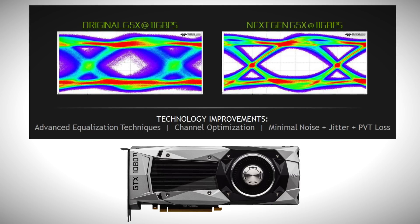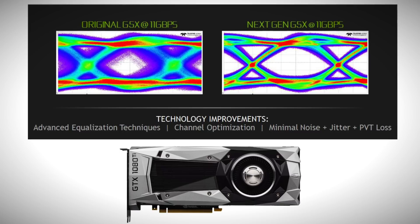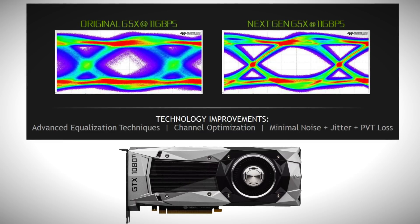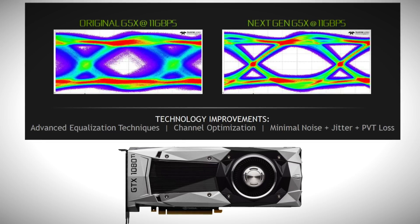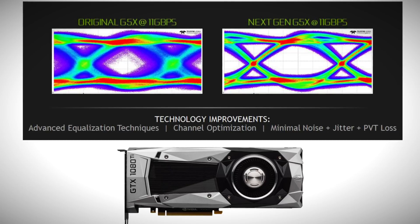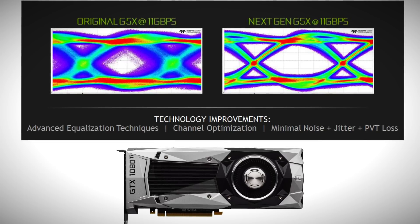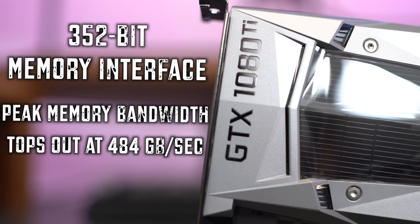The big thing they've done with GDDR5X is make it work absolutely better. Instead of having any clutter, the new generation tech means the memory just works much better all around, making the card run faster. The image on the left shows the original GDDR5X DRAM running at 11 gigabits per second where the data sample center is cluttered with values in transition, making it impossible to capture data reliably. The image on the right shows the new GDDR5X design with a dramatically improved data eye that, combined with Pascal's robust IO design, enables a new bar for DRAM IO speed. When combined with the 1080 Ti's 352-bit memory interface, peak memory bandwidth tops out at 484 gigabytes per second.